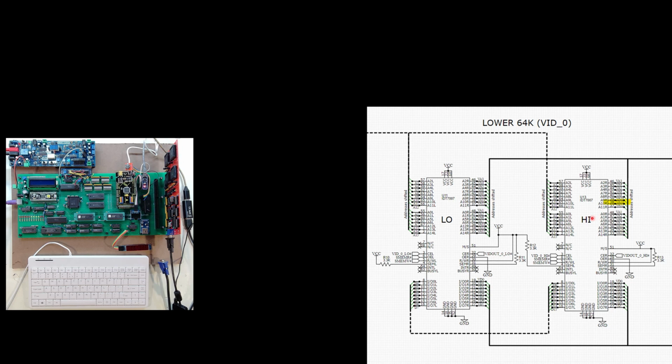So interestingly, I went back and looked at my schematic, and this says lower 64K, which is the A0000, which is the top part of my screen again. I've got the paired static RAMs, so this is my 64K, and I've got the low and the high byte, and I missed updating one of these net labels. Over to the left you can see it goes VA 10, 11, 12. That's what I should see over here, 10, 11, 12. Well, I have two 10s, and that basically results in every time I write to that odd address, I'm getting that duplicated pixel, because this isn't an 11, it's a 10 on that also. So that was a problem.